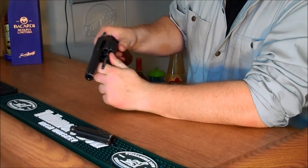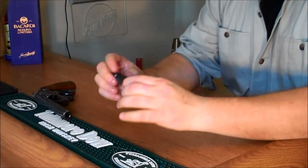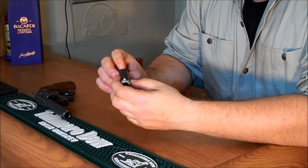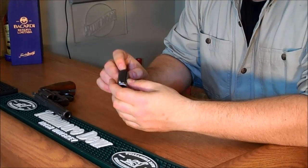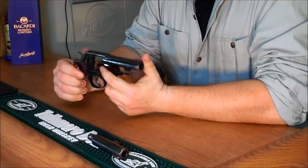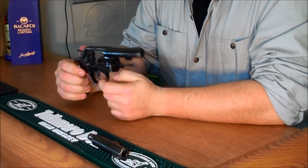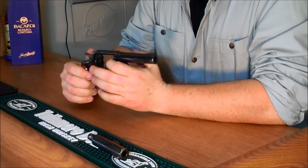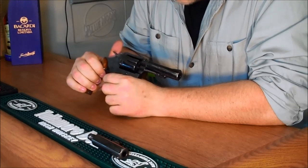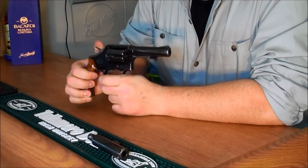At that point I ordered this barrel on eBay for about $30. It was luckily longer and hadn't indexed at the same point, so as the old barrel was indexing here, the new one was screwing in about here — meaning I had some extra space to go a little bit tighter. Every time you tighten it, the barrel goes a little bit further, so everything lined up. The only problem was the forcing cone was a little too long because of how the barrel was previously installed, so I did have to shave down the forcing cone a little bit to get a perfect fit that didn't drag. Now the gun shoots awesome for the cost of a $30 barrel and a little bit of work, so for me it was worth it.